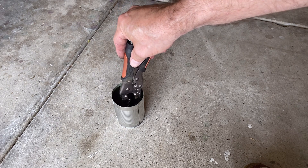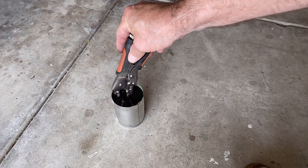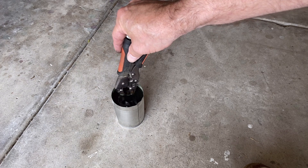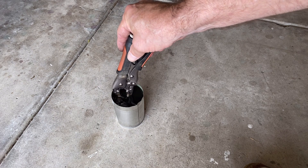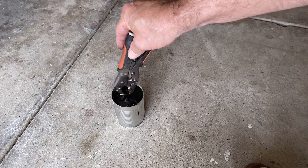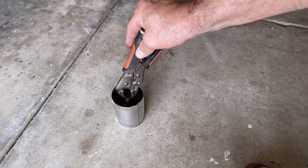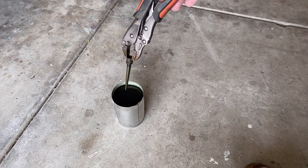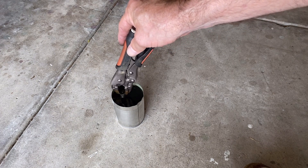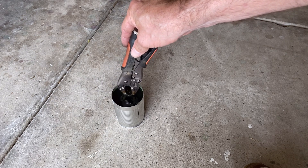Let the quenching take about 20 seconds. This is also called tempering. The first step was hardening, and this is tempering — because I'm making it less hard. I'm tempering the hardness, making it so that it won't break if it gets dropped or shocked somehow. After we do this, we'll polish it again to take the blue color off. Then we have to grind it and put a sharp edge on it. That'll be the third part of this video.